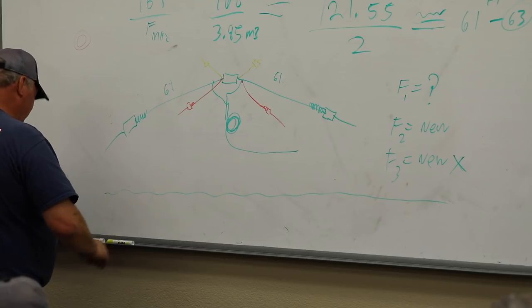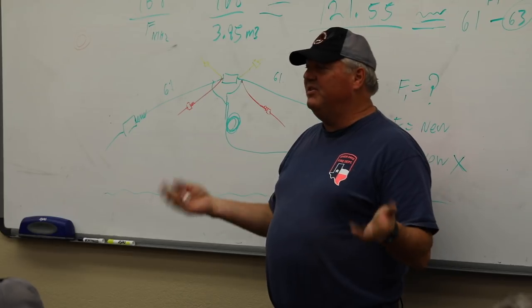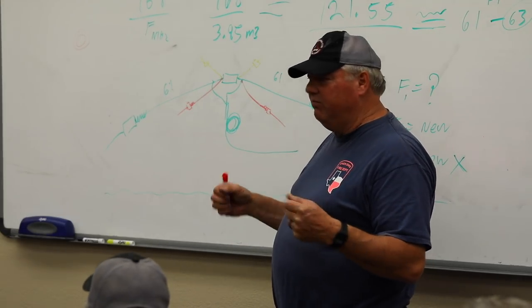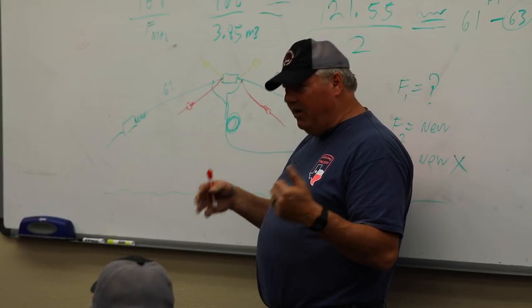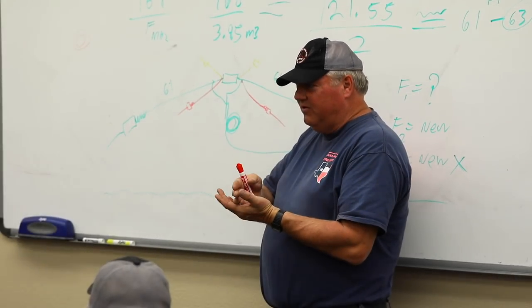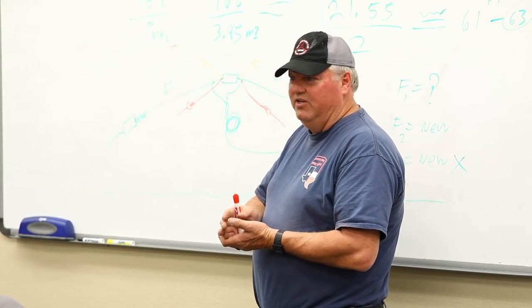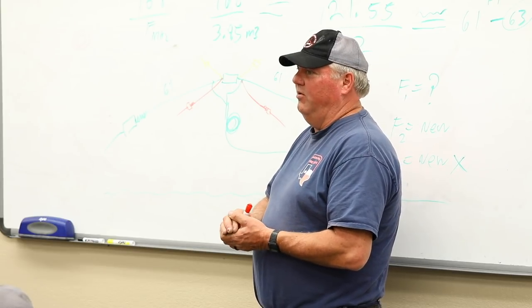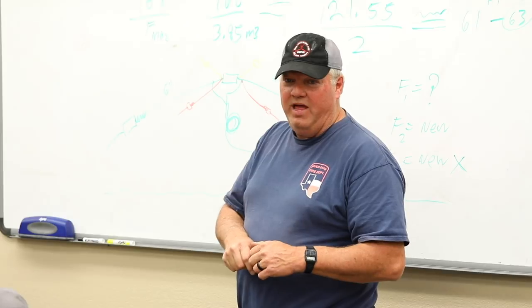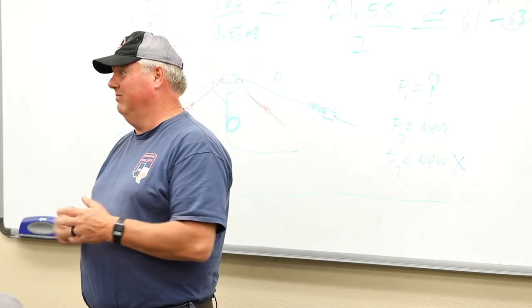So now, my particular setup, and just keep in mind, everybody's setup is going to be different. Everybody's going to finesse theirs differently. This is just what I do. I'm not telling you how to do it this way. I'm saying stick to the resonant frequency, stick to the resonant antenna plan when you build your first wire antenna, because it's just easier, okay? And it works. You're going to hear people and they're going to hear you. If you build the weird, psychopathic, squirrely, cylindrical, round antenna thing, they're complicated.